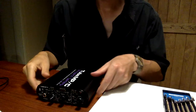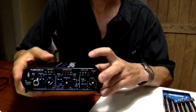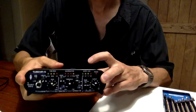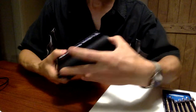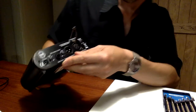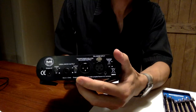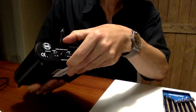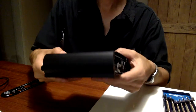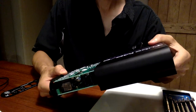Alright, you've got me halfway through the surgery. So the whole unit — I haven't seen anyone take one of these apart online yet — there are two screws on the front plate that you have to undo, and then on the back there are five screws that you take out as well. So you take off all those screws — they're little short screws — you remove this back plate here, and then the whole unit carefully slides out from the casing.